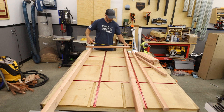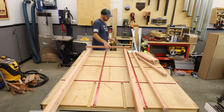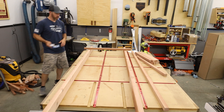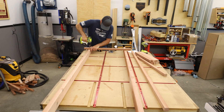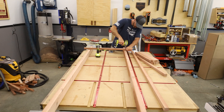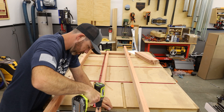So these are the staggered slats, these are the top and bottom, this is the vertical piece, and these will be the legs. I've got these laid out — the legs are going to be 26 inches apart, and I'll check on both ends to make sure they're good. The bottom piece goes nine and a half inches up and should stick out three inches on each side. I'll get the top and bottom put together first so the boards don't bow while I'm doing the rest. I'm not going to countersink too deep, just enough to make the screw flush or a little below the surface.